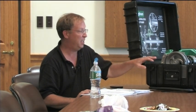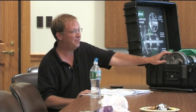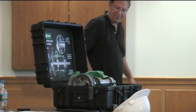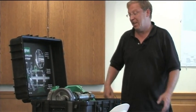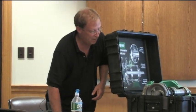This is a nice pump to work on versus the early ones, because it's that back pull-out design - you can leave the volute right in the pipeline. You've got the external adjustment, no more paper shims, the seal is a lot easier to put in, and there's no alignment with the pump. It's either stuff goes in and stuff goes out.